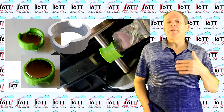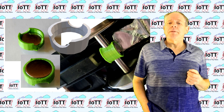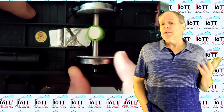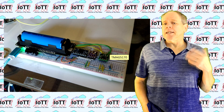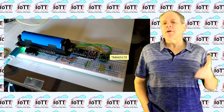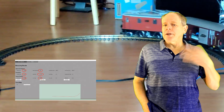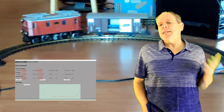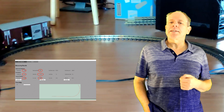For the rotation sensor I showed in video number 81, I used two 12 by 3 mm neodymium magnets, one on each side of the axle with a diameter of 6 mm. To hold the magnets in place, I used a 3D printed holder for each magnet with a cutout for the axle. The magnets attract each other and the holders keep them in this coplanar arrangement. The sensor itself is inside the car at a distance of about 35 mm or one and a half inches above the axle. The magnets can freely rotate with the axle and do not touch anything while the car is running on the track. The sensor continuously measures the rotation angle of the axle and counts the number of revolutions to calculate distance and speed.